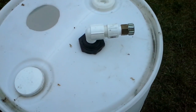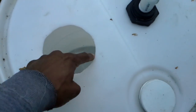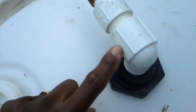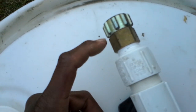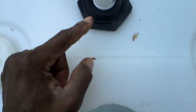Hey, it is Nigel. You asked me to make this video for you, so here we go. Here's a 55-gallon drum with a borehole to accommodate the Hudson float valve. That Hudson float valve is three-quarter inch. I got some fittings from Home Depot — one inch to three-quarter inch. You'll find those in the plumbing section. This fitting came with the Hudson valve. Once the water reaches the top, it cuts off and doesn't overflow.